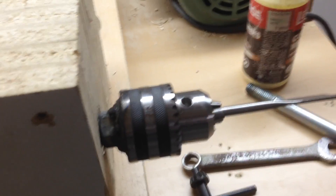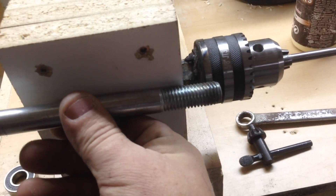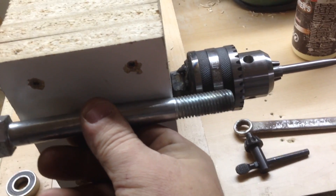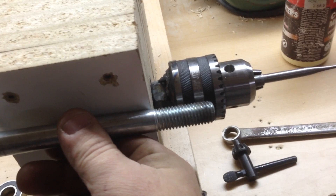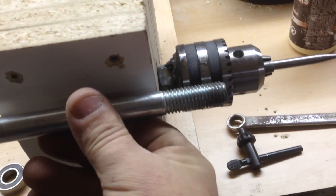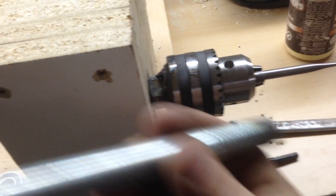The other thing I talked about was having to put a lock nut on it — well, I don't even have to do that. What I'm finding is there's enough room in this big chuck here that the bolt will be able to go in and bottom out on the nut, and then I don't have to have the lock nut. The more this thing tries to turn — the more the motor tries to turn — the tighter it would try to make it.